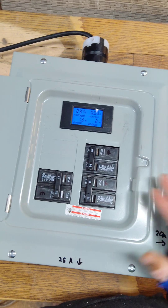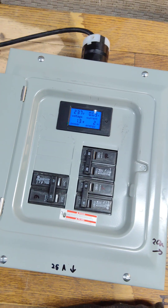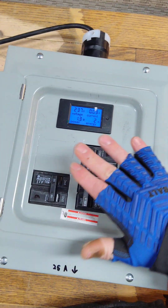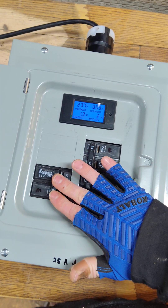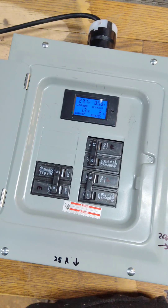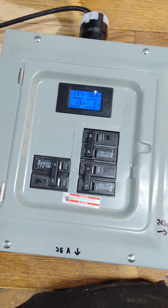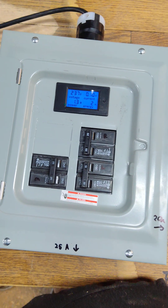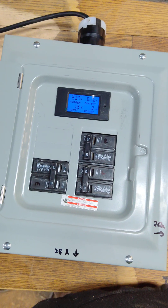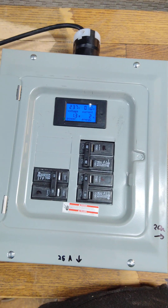These are made to order for everybody. Usually I put an outlet for a big machine on a 25 or 30 amp breaker depending on what machine you're running, and then a 20 or 15 amp 220 outlet for whatever other equipment you want to run off of it. This particular box has NEMA L6-30 30-amp twist locks in it.